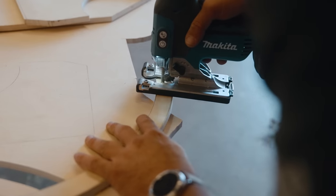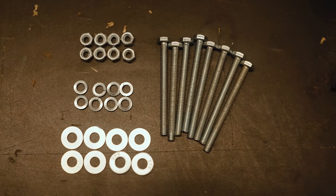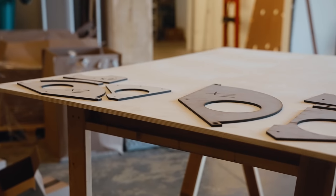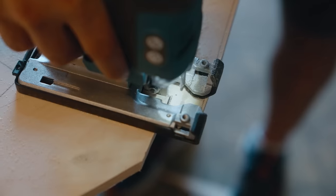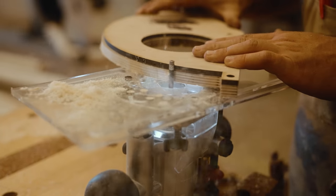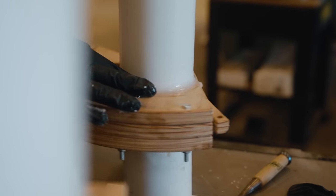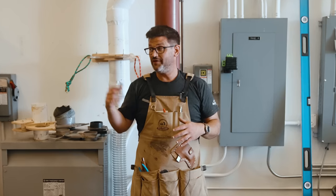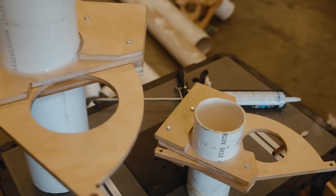They only take three tools: a router, a jigsaw, and a drill. It takes four bolts, eight washers, and four nuts — easy to make. We have templates available as well as digital plans; you can print the templates and tape them together, or buy MDF templates from the CAM Tool store (link in the description). Trace them, cut roughly with a jigsaw, flush-trim with a router, assemble, and make sure the washers face your tool. I glue and caulk the PVC in them — it fits perfectly — and they really save money. We have six-inch and four-inch versions.